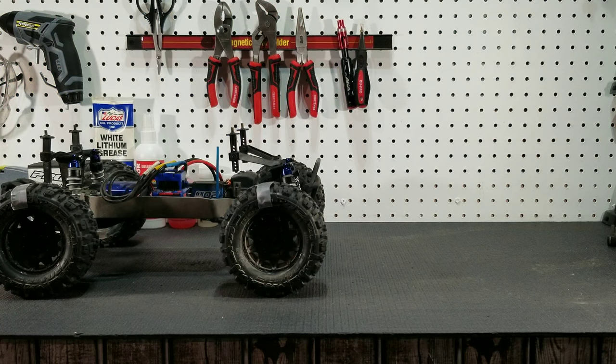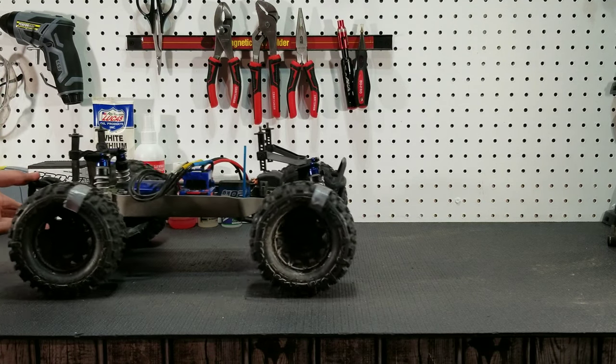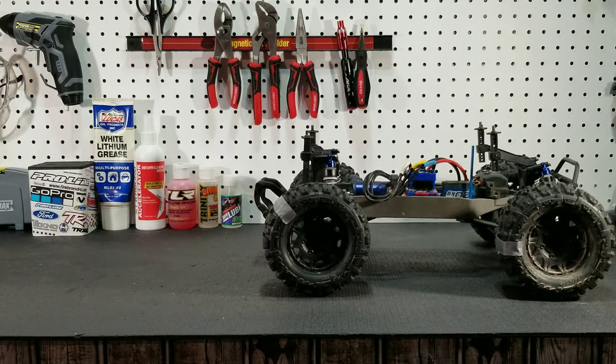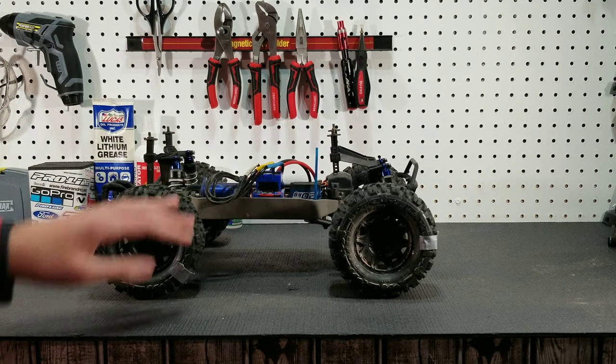So this clip is being filmed after the fact, and I'm just adding it to the video so you guys can see this. This does prove that the gear ratio is different — I have two pieces of duct tape on the tires and they're in the same spot, and you can see that they are not aligned. So yes, we will have to wait to drive this thing until we get the upgraded gears for the front diff, so then both of these will spin at the same rate. All right, cue the outro. We'll see you next time on TraxRC.